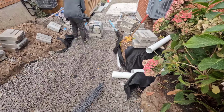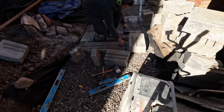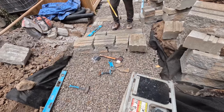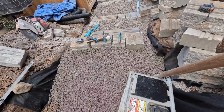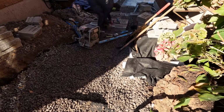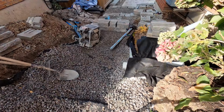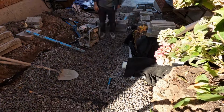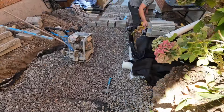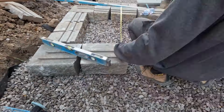So instead of having to use our rotary laser level, or in this case our U level, to know exactly where that next step is going to be, we just level our 3-inch block for our next step to the top of the previous step's wall block before the cap goes on top. Now, if we wanted to have 7-inch steps, we couldn't tie them together and be much more structurally sound with this step staircase, which I prefer, especially with the walls going up the sides as well. So that's why we opt for a 6-inch step, as well as the 16-inch treads allows us to go to that 6-inch mark for the steps. The longer the treads, the better you are going with a 6-inch tread rather than an 8-inch.